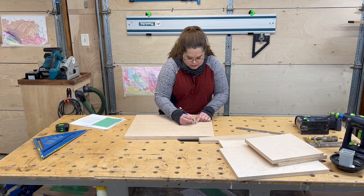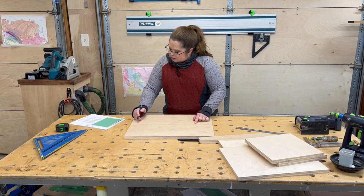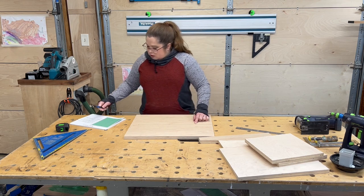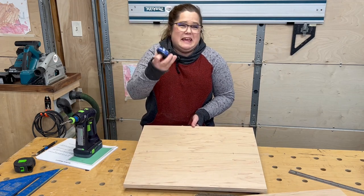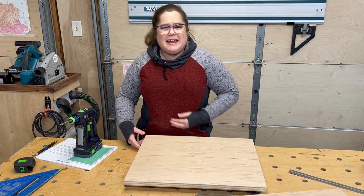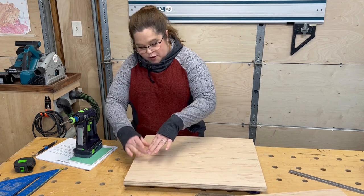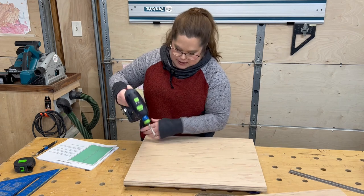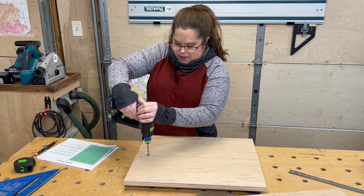I have my line going vertically, and I've got my top and bottom marked. The next thing I'm going to do is drill a hole at the top mark and at the bottom mark with a quarter inch drill bit. I found some bench cookies — basically something that holds your work up so that when you drill through, it won't go through your work surface. Anything that will securely let you put your board on it will work — honestly, a couple of thick books would be good, just make sure they're away from where you're drilling. At this mark, I'm going to drill with this quarter inch drill bit. It has a really pointy end that I'm going to stick right where my lines cross, then gently push down and pull the trigger and let it do its work, then reverse out.